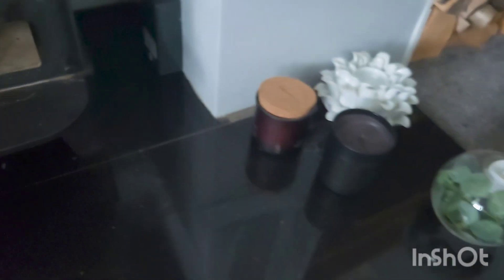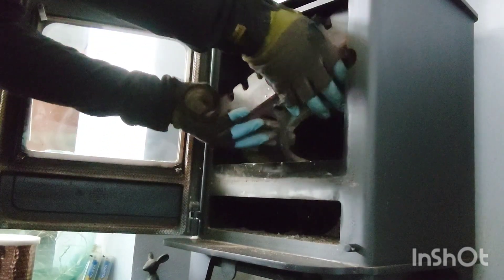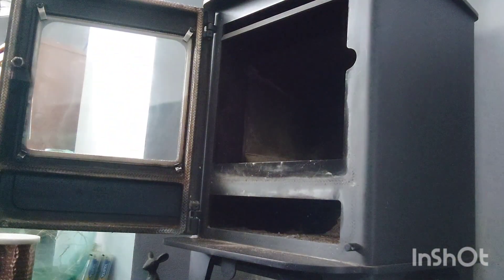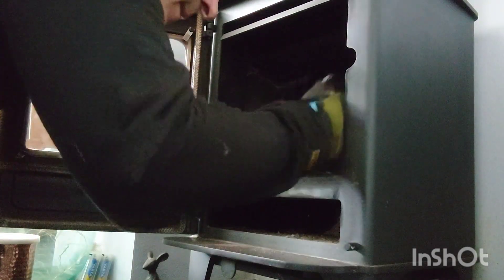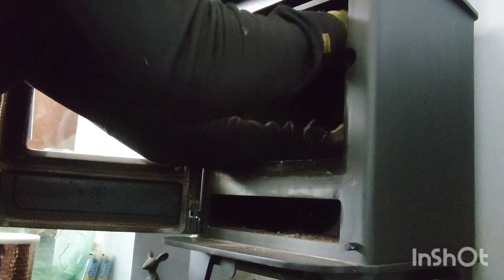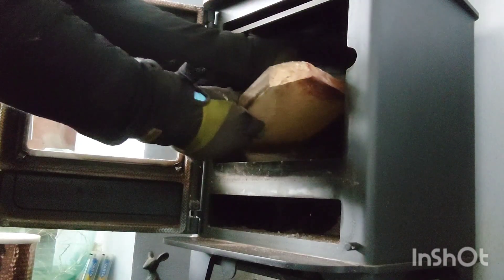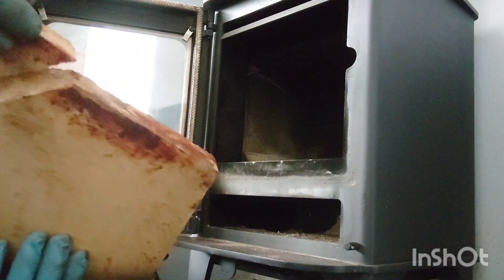Right, I've been really itching to do one of these because they're great ones to know how to do. Basically you take this out like that and then you can put it to one side behind you. That gives you access to the fire bricks. Then you lift up — this fiber is crumbling away a little bit on the side here, but it's not an issue. Then you can get access to the fire brick; as you can see it's crumbled and broken away, but that's not a problem — it'll go back into position.